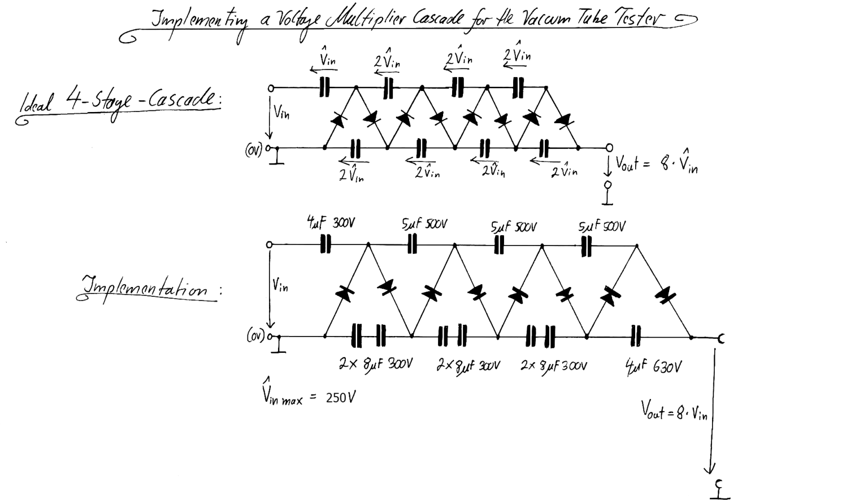The peak voltage is limited by the capacitors to 250 volts DC. Therefore, 2 kilovolts will be the absolute maximum output voltage. I do, however, believe that though exceeding the ratings, 2.4 kilovolts of output voltage would be technically possible.